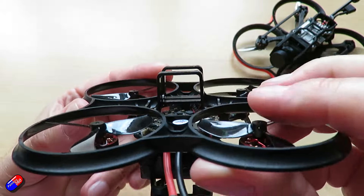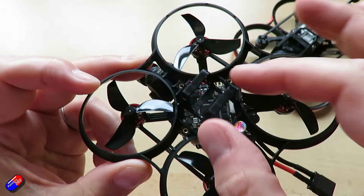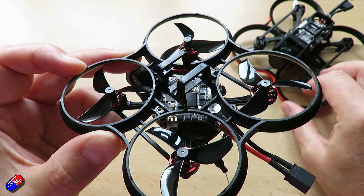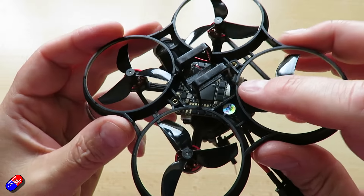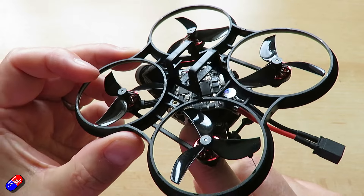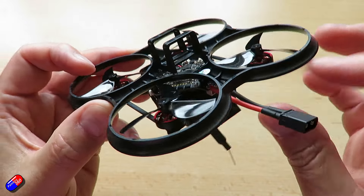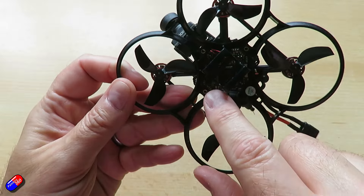The battery slot is on the bottom and takes the supplied battery with a nice snug fit. However, you can adapt the bottom - it does unfortunately require snipping bits of plastic off, but you can get a Velcro strap through if you want a slightly bigger battery. It's a new F4-based 2-3S 20-amp all-in-one flight controller, an upgrade from the F4 1S 12-amp in the first version. It also has an inbuilt ExpressLRS receiver, with the status LED located underneath.